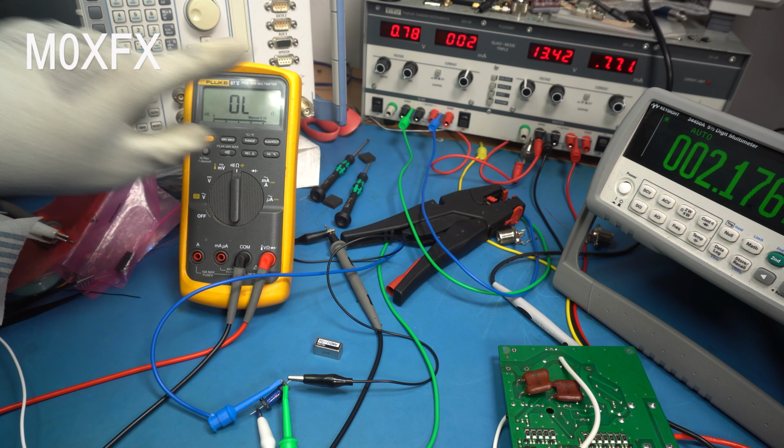Well, it's running under its own steam. We're actually plugged in the proper antenna socket now, and it's working. Now, unfortunately, it's not transmitting. This is as far as I'm going to go with this video today, so there'll be another video. We're getting absolutely no RF whatsoever, so I've got no idea what the issue is, but we'll attack it in the next video.